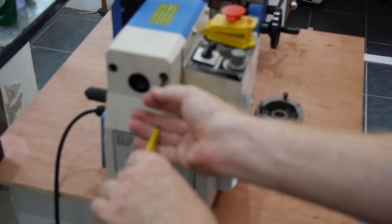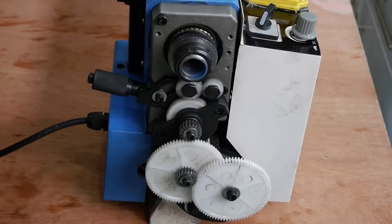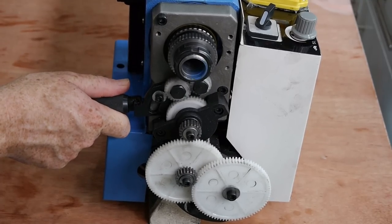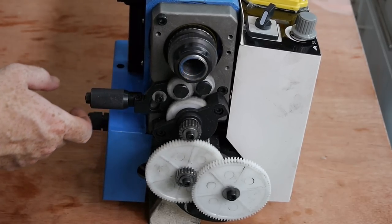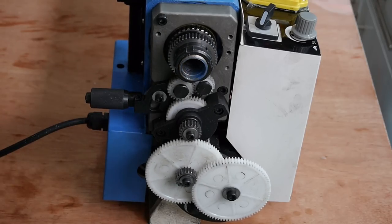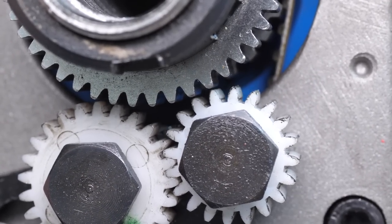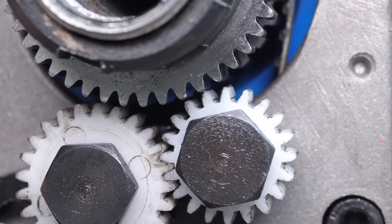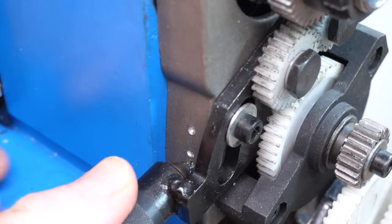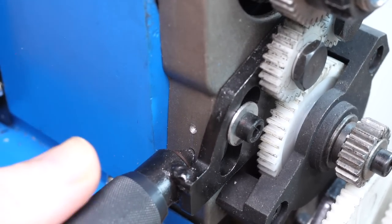The next thing I want to look at is the drive mechanism and feed gears. When I tested out the lathe it made a lot of noise, and the spindle didn't turn properly. The first obvious problem is with the feed selection lever. It works fine in forward and reverse directions, but in the centre position it doesn't disengage properly. The range of movement where the gears are completely clear is very small, and the lever's alignment is slightly off, meaning that the gears rattle and the feed screw turns when it shouldn't. In addition there's a lot of play in the lever mechanism, so even if the centre detent was in the correct position, it still would probably not disengage reliably.